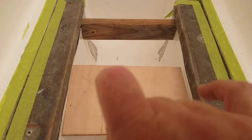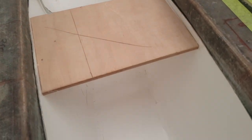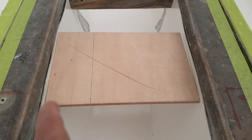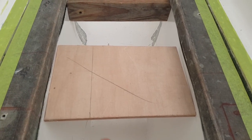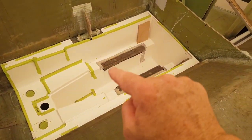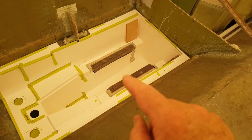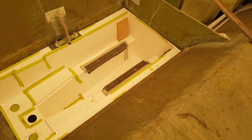These flaps are going to go out, and I need to chop them in place so they actually bond to the foam bolsters underneath and form a very good seal. And then I'm going to tie that back in to the bearer itself up over the top, thereby making it almost one piece all the way around. That's the plan. I'm pretty happy this one's now solid in place. I've now filled in around the bearers here, so that's all connected there now. And in fact, I went home for lunch, and that's a 24-hour epoxy, and that's already set in 3 hours. It is about 32 degrees in here right now, so.